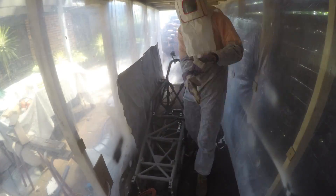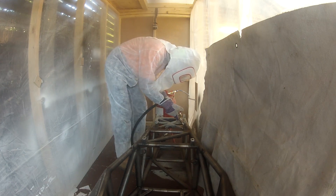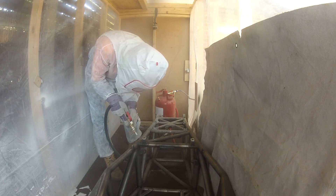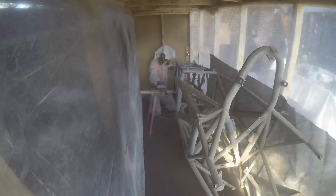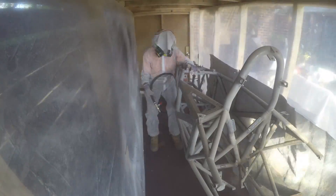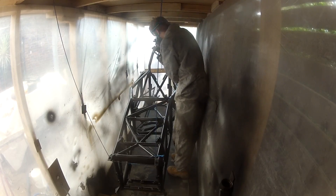To complete the chassis it needed to be painted to provide a protective coating for the steel. We used a ventilated booth my father built to first sandblast the entire chassis, removing any grease, oil, scale and rust to leave a clean surface perfect for painting. The sandblasting was a really dirty process — it creates a fine dust which combines with the sand and gets everywhere. Every 20 minutes or so I had to stop, collect the sand from the floor, sieve it and return it to the canister to be reused. The nozzles would also wear out, so we made custom ones on the lathe. After sandblasting, I used a matte black paint and went over the entire chassis with a couple of coats.